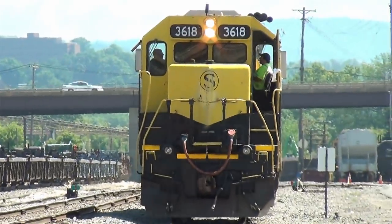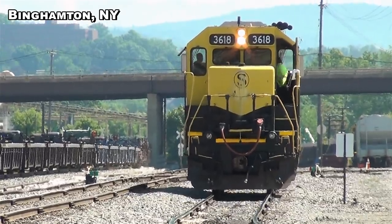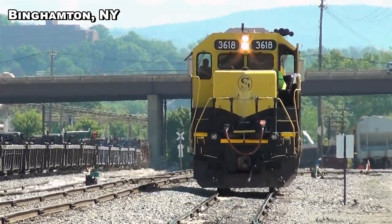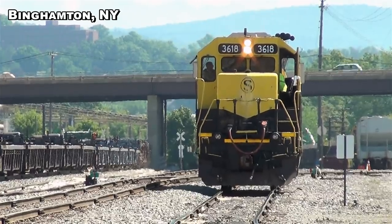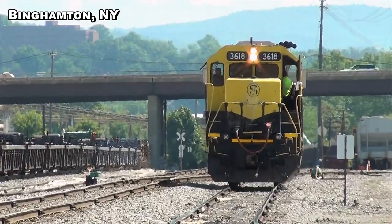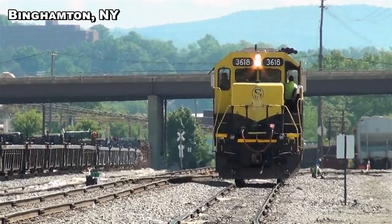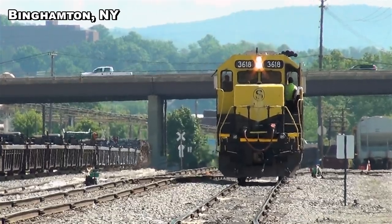Contrary to popular belief, the SD45 was not a gas guzzler, but it did have its problems. Although it produced more power per unit of fuel than its 3,000 horsepower counterpart, the SD40, it also sucked down more fuel when idling than an SD40, which was a problem since U.S. railroads tended to leave locomotives idling when not in use, particularly during the winter months.